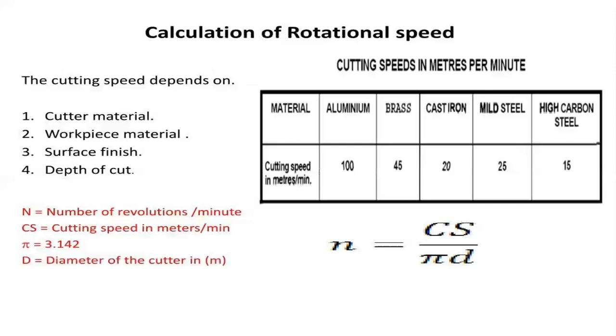So how do we calculate these speeds? Nowadays, we have digital tachometers for identifying the speeds maintained within the arbor or machinery unit without any contact. They use optical technology with UV radiation: the transceiver transmits the UV rays and receives the signal back at its source, and the 7-segment display shows the speed as a number directly.